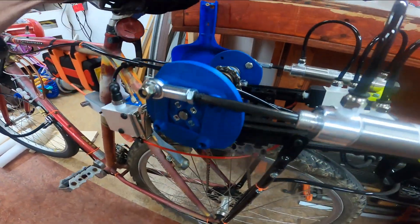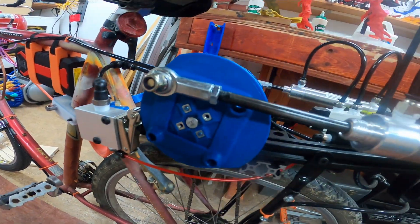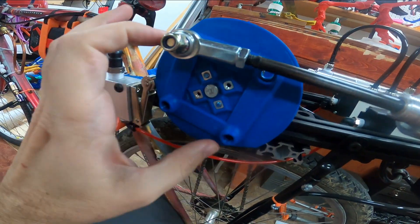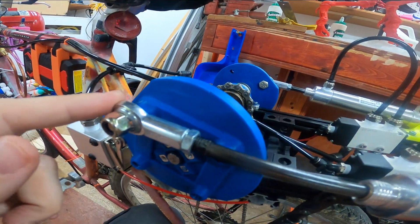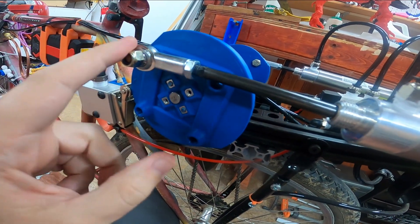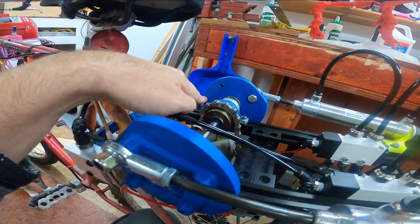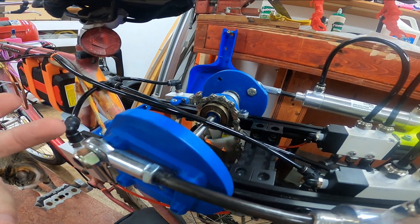The biggest question was: can you do it? The 3D printed cam creates a nice square arrangement here, so I can line these up. These are 90 degrees out of phase, so at any given point one of these is pushing on the top while the other is at sort of dead center, where it can neither push nor pull.